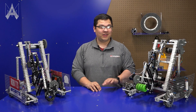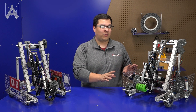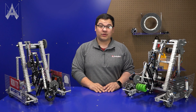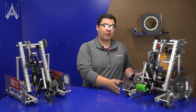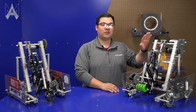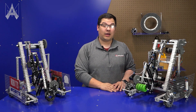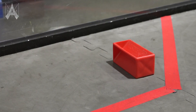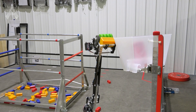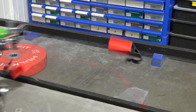This claw is built from all the components available in your Robits core kit. When upgrading this robot we had to make some design decisions on how we wanted the robot to play the game. For example, by increasing to a four-inch mecanum wheel it raises the height of the robot off the ground, which required us to slightly change some of the mounting so that it fits inside the 18-inch starting cube. With the roller claw it was easy to acquire game pieces off the floor, but it did require us to no longer be able to score in the upper location, nor does it allow acquiring the clips from the wall.